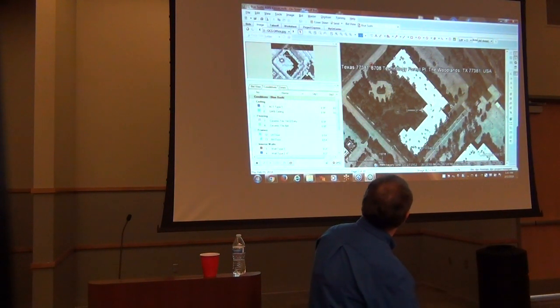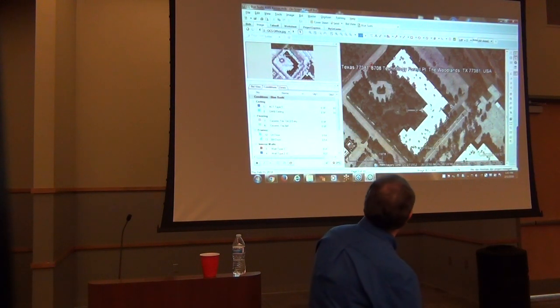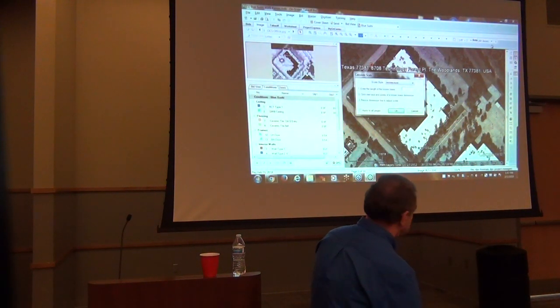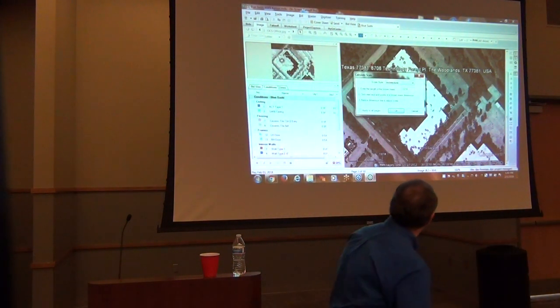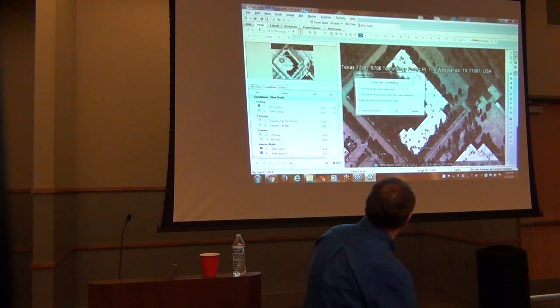So now I get a phone call and I'm on another project, and they said we need a 3-foot parapet wall on this building. Give us a rough number and hurry. So I've got this, I've got that. I'm going to go to Edit, Calculate Scale. The known linear is 192 feet. That's 192.00. The last 2 digits are inches, 192 feet, 0 inches. And step 2 is to click and drag from 0 to 192 and let go. My scale is 1 inch to 91.6 feet.